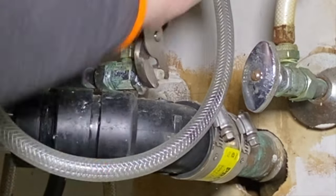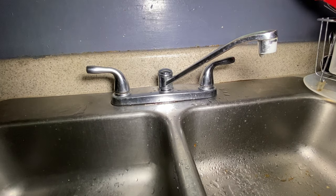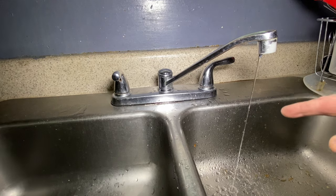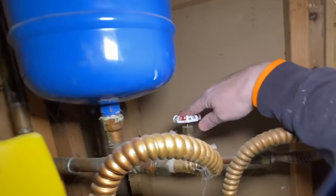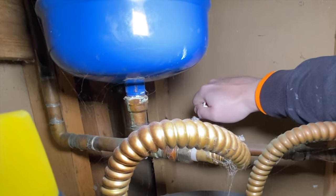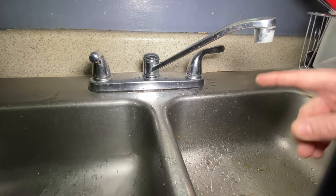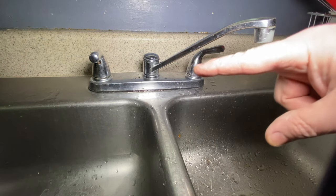Bummer, man. I hate doing this to a valve. So I shut that valve off but it's still leaking a bit, so I had to go down and actually shut the water heater off. Let's see if we can get another crank or two on this valve. Maybe we can open something downstairs and get this to stop. So we opened up the faucet downstairs to get that little drip to stop up here, and now we're actually going to be able to change this out.